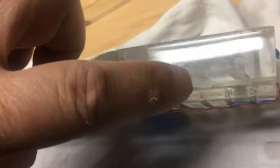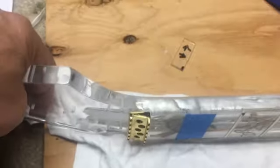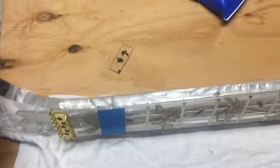It's hard to see maybe, but you could see the spline go down to about here in the side view. Yeah, I think right onto about here. So about 3/4 of the way through the neck. I'm gonna try to make this thing look nice. Also, at the same time, I sanded down the front, the fingerboard side. It was a little proud, so basically I sanded down so I have a flat surface for the frets to go on.